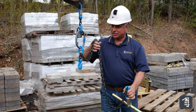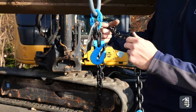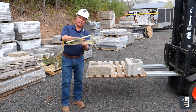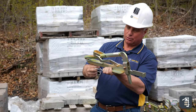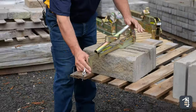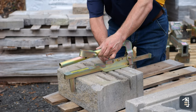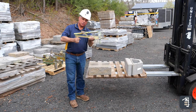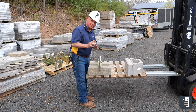The unique part about our chain is that you can adjust your height, and perfect height is crucial on a job site — the last thing you want is to be fighting against the bucket or the excavator arm. Another unique feature built into the BL180 is this quick pin, which lets you adjust the width for whatever product you're picking so you don't have to continually readjust. Set it, push it tight, and put your pin in. Now you don't have to worry about it bumping or shifting — every time you set it, you're ready to pick your product.